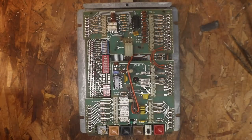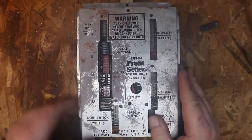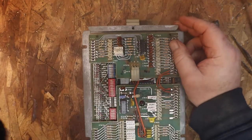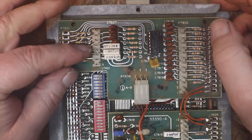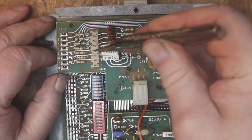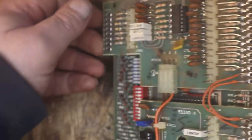Take the cover off. Here's our keyboard pad right there. Number five pin — one, two, three, four, and five — and looky there, it's even labeled for us down in there. Now we need to pull this apart so we can see where our number five pin goes to. You can pull these top boards off pretty easily — all I have to do is pull them up off of the through-board connector. I cleaned every one of these pins on this.